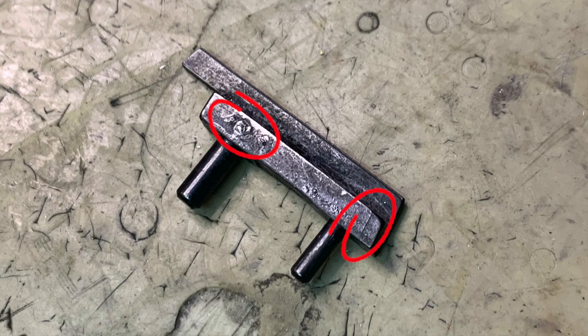The plunger tube — I've seen so many failed plunger tubes in general. It's a difficult part to get just right: you want correct hardness, correct geometry, correct everything, because if your plunger tube falls off you're pretty hosed. Metal injection molded plunger tubes are just a no-go. The ejector also takes quite a beating, and I don't want to roll the dice on whether I got a really good MIM ejector or a bad one.